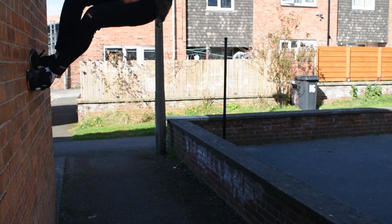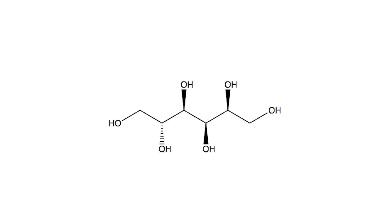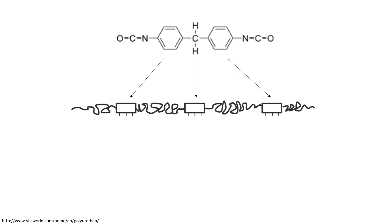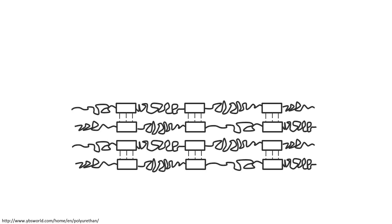On the other hand, polyurethanes are generally stronger and have better abrasion resistance due to their unique internal structure. Firstly, if they are made from monomers with more than two functional groups — for example a polyol is used rather than a diol — then naturally branched and cross-linked chains will form. Secondly and more importantly, polyurethanes are made stronger due to the effects of hard and soft segments. The diisocyanate sections are hard as they contain inflexible benzene rings. The long polyol sections are soft because of the high amount of free rotation in the singularly bonded carbon backbone.